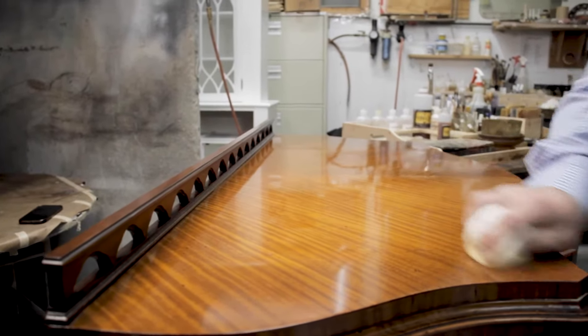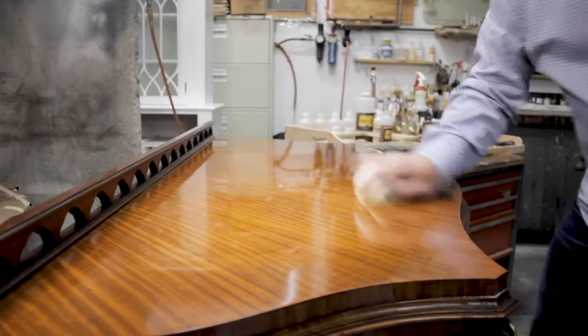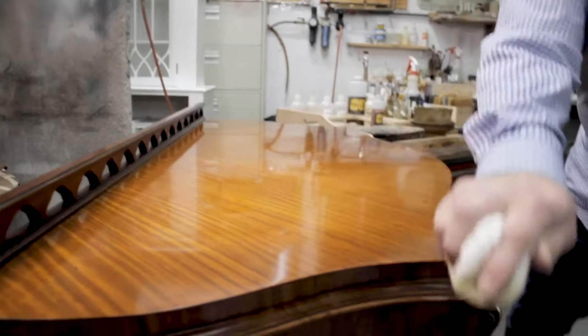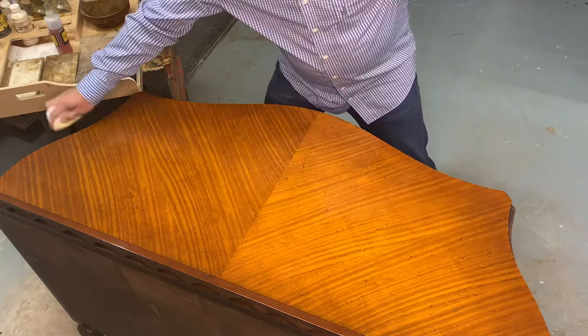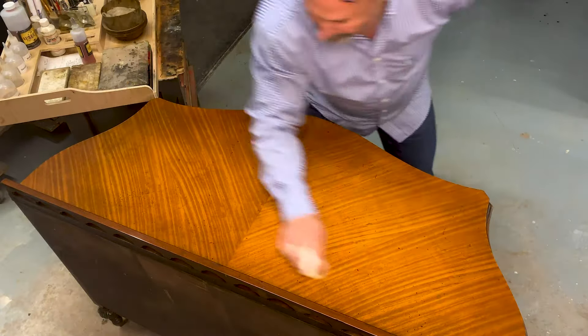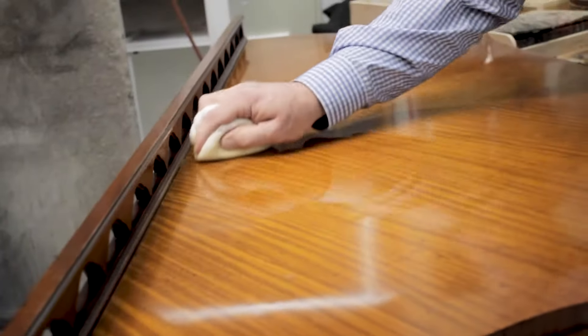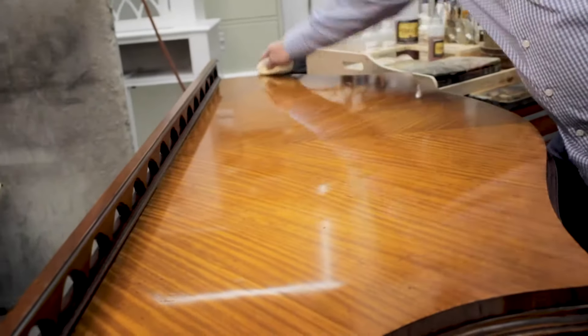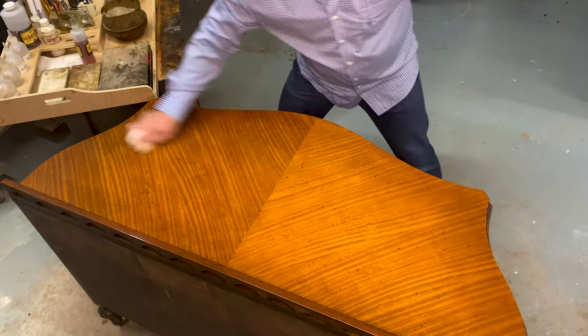I am now applying a lot more pressure because I've extracted the Lubricite 77 onto the object — less is on my pad — so I have to press a little harder. Sometimes I go a little faster to start to burnish. It's just a little harder and faster, and it gets a little more sheen. That faster motion creates a little friction, a little heat, and somewhat burnishes the surface.